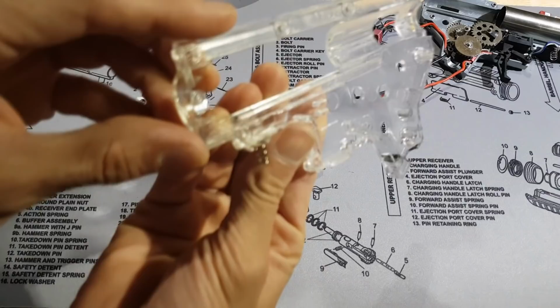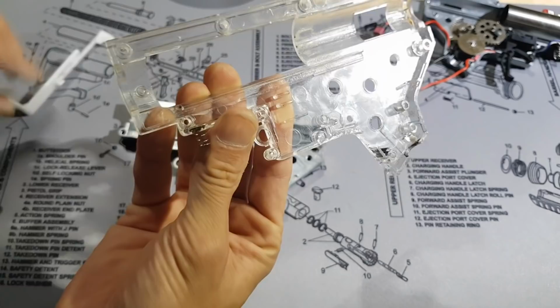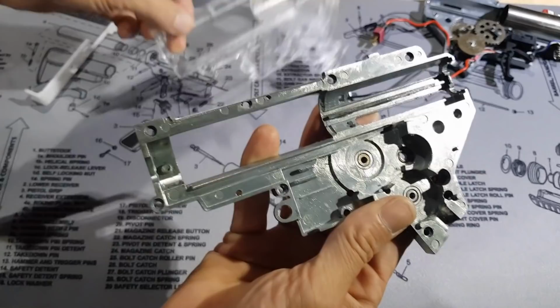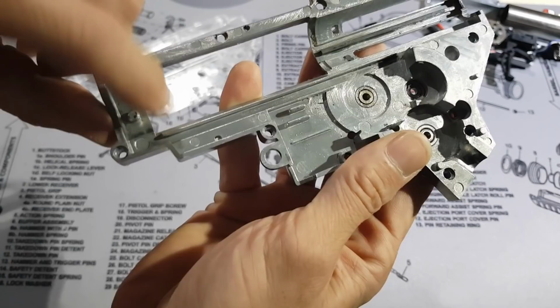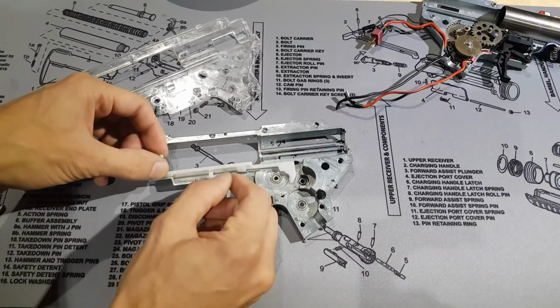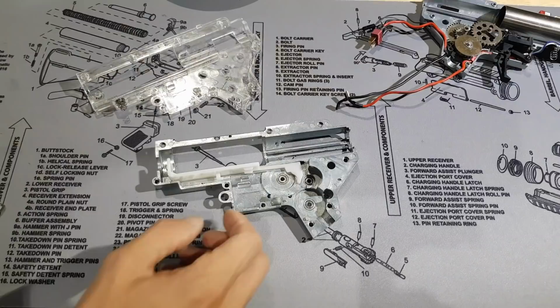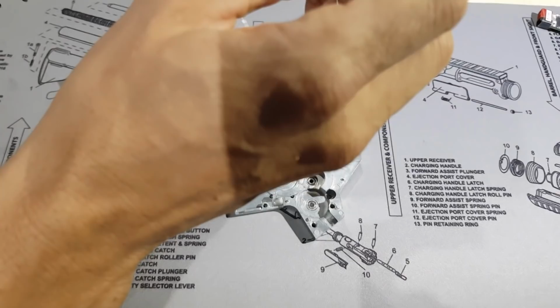So despite the fact that the boxes are identical dimensions, the sliding rail for the Wells tappet plate, knowing that the tappet plate has to go back further, actually, you see, it ends just there. So on the APS, the rail ends there. So you can see, well, that's a good shot there. Obviously, you can see the difference there. So this notch in the rail for the APS box is going to have to be Dremeled out so that I can get the full movement of that tappet plate when I put the new cylinder in there. Even though the cylinder's got the space, I'm going to have to bring that rail back a little bit, just a smidge.